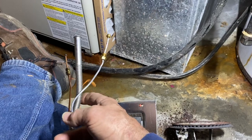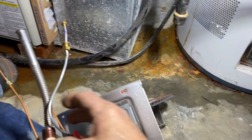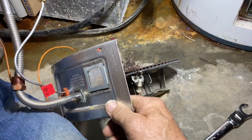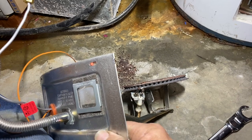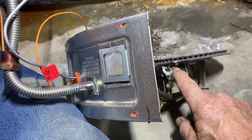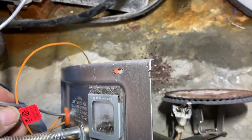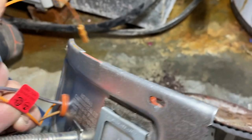I don't know if you all even want to know how a gas valve and a gas appliance operates. This in here has been LP, but it doesn't matter — natural gas, LP. These are somewhat changed compared to back in the day. I've worked on hundreds and hundreds and installed many, many of them back in the day. But these new ones now have a piezo electronic ignition, a little push-button ignition — not electronic, but a piezo coil just like a barbecue pit. I'm kind of a little bit behind the loop on that one there. But it still has the same thermocouple.